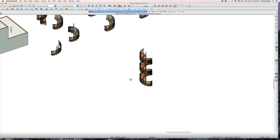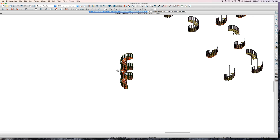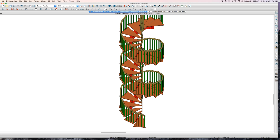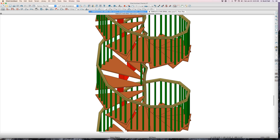As I said before, when I do my stairs I can only do less than 360 degrees — I can't go the full circle. I need to figure out a way to build these stairs in a full circle. This is Yusuf's spiral stairs. You'll notice there are 33 treads here. What don't I like about this method? First of all, the edges of these treads aren't curved. That goes back to part one — how you make them out of pieces and get them curved. I don't think you can curve these things, unless you put them within a wall and make them winders, so the treads will be curved, but then you have to turn the walls off.